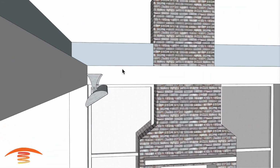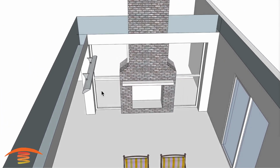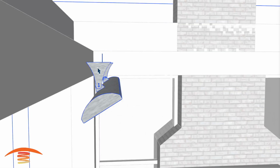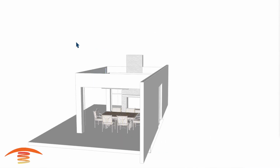You can see the ceiling is gone right now, but when you take a CD6024 and mount it at a 30-degree angle to point it towards the center of the seating position, you need to lower the heater an additional 6 inches. So this bracket here gives you a 6-inch clearance, and then you need an extended bracket. So there's an extended bracket, which is this part right here. Let's see if I can tap it. This one right here is the standard bracket, and then there's one that's a 6-inch longer or taller bracket that you would want to purchase separately.